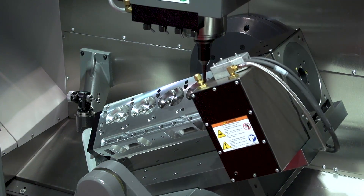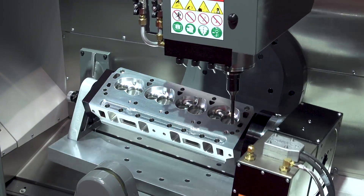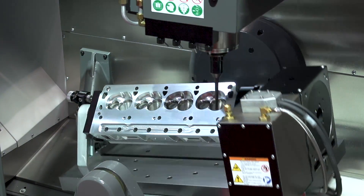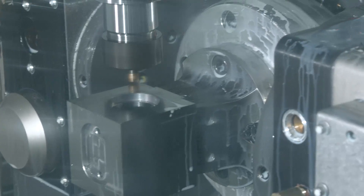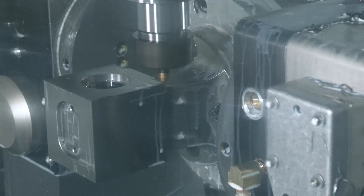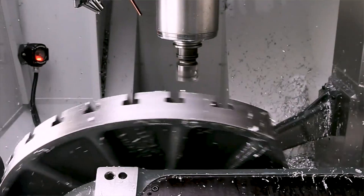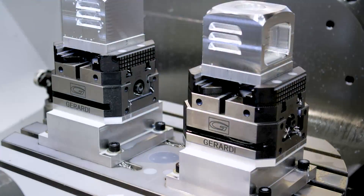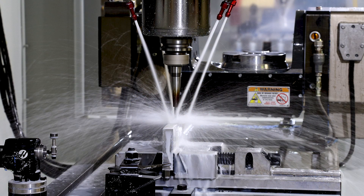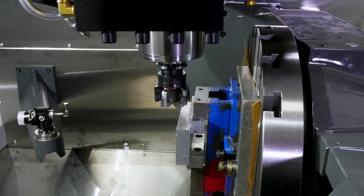The rest of this video series will focus on 4 main things you need to do to be successful. The first is configuration — what type of machine and rotary product combination is right for your application, or which gives you the versatility you need for success. The second consideration is workholding — how will you hold the workpiece to present it to the machine spindle? In most cases, a standard mill vise will be inadequate for a number of reasons, and we'll discuss all those details.